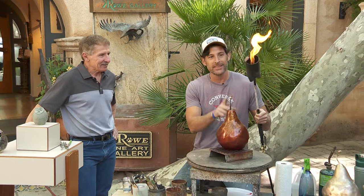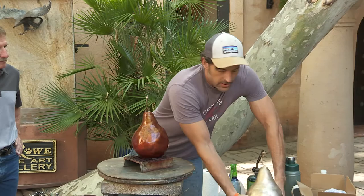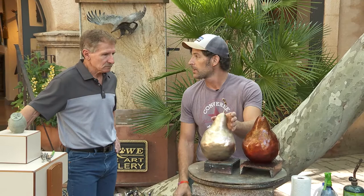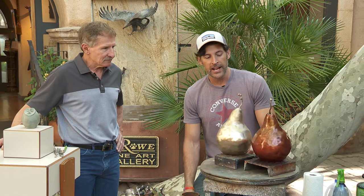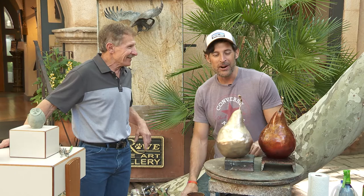What did we start with last week? Here I have another one of my pair. So this baby started like this last week. We heated it up with that big torch, and I started applying the chemicals. Ferric nitrate was the main chemical. I showed you how we make that at my shop by pouring nitric acid on nails. There was a minor explosion, but that's part of it sometimes.